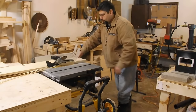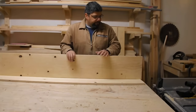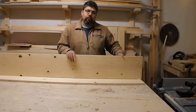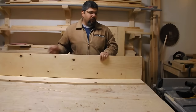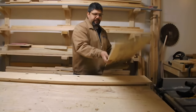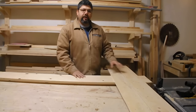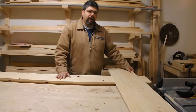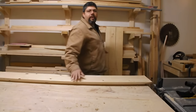We're going to get to sawing the lumber. That's going to be three of these cut down into 19 and 7/8 inches, and the other one is going to give you seven end pieces at 12 and a half. We're going to work over on the miter saw. If you don't have a miter saw, you can either do it with a hand saw, or you can take one of these jigs, set them up on the length that you need, and run your circular saw off. It takes a little more time, but if you're using plywood hives you're probably not making too many — maybe four hives at most. One sheet of plywood will make one hive, because you're going to get five brood boxes — five deeps — and one medium out of this.